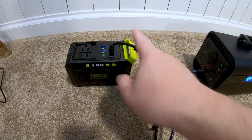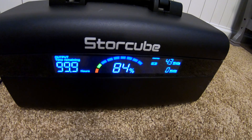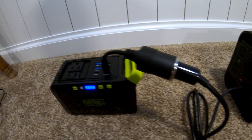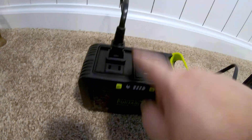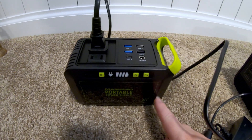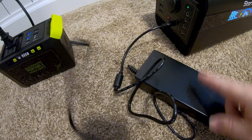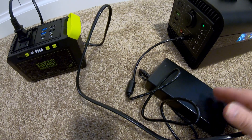I want to see what happens with the DC out. It looks like we're substantially less than 100 watts — we're at 43 to 44 watts coming out of the 12-volt outlet. Next test: let's see if we can overload this inverter. It's a bit challenging because it's a modified sine wave inverter and motors don't work very well, so going to a power brick that converts to DC is a good approach.